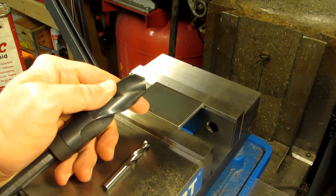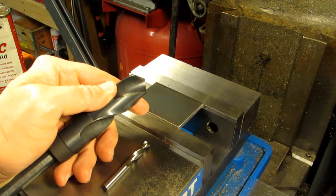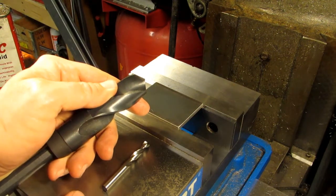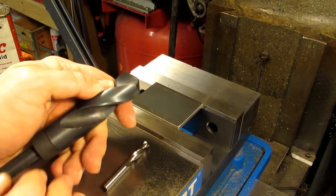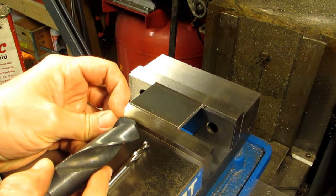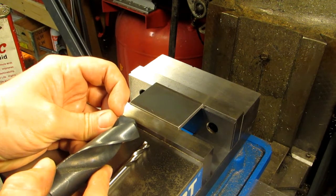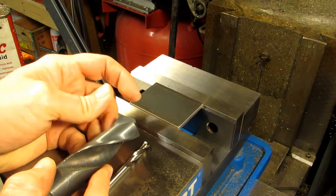One, you grow old and gray by the time you're done drilling the hole, and in a machine shop environment time is definitely money, so you want to get the hole done as fast as possible. Second, it really wears the drill bits down quickly, because if you're drilling an eighth of an inch at a time you're only cutting on a sixteenth of an inch on each cutting lip. I've seen a lot of drill bits with that last eighth to sixteenth of an inch just burned right off because that's all it was contacting.